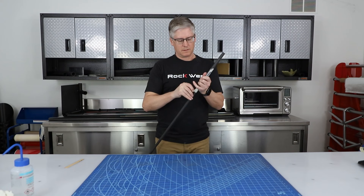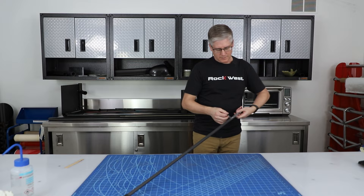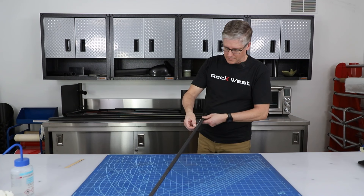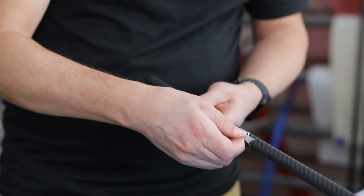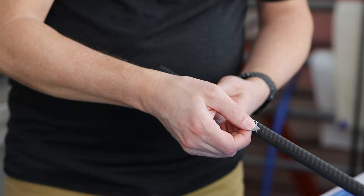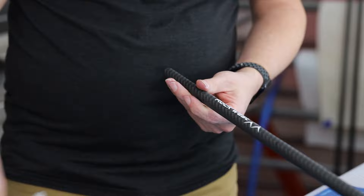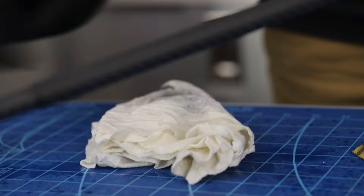The tape is shrunken and cooled, so now we're going to take it off. Then we'll clean it again just to make sure we haven't contaminated it. This vinyl sticker has that secondary piece on it and we want to make sure we take that off. You can see how well the heat really helps keep everything in place, especially these little tiny fragile points. Just want to make sure it's super clean and doesn't have any fingerprints or oil from my hands. I was avoiding running the alcohol over the graphic because I don't want to risk getting solvent under the adhesive.